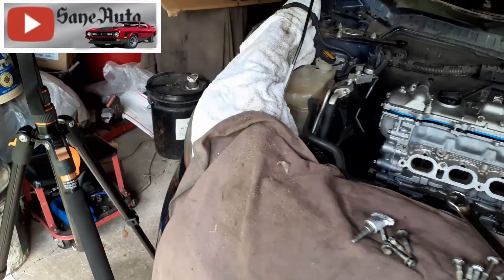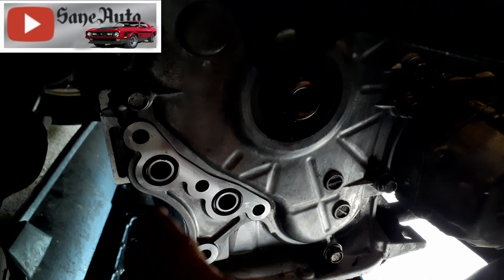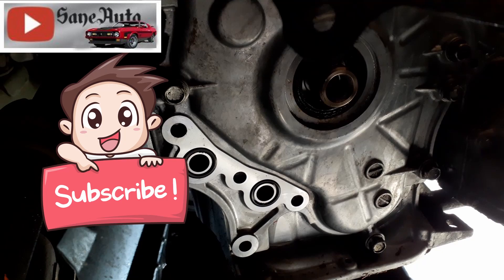Let's take a look. Go over to the passenger side — and you don't have to take the wheel off like I do. There is a filter housing right here and the filter faces over toward the transmission. The whole filter housing bolts on here, and I've taken it off so I can get it on the bench and show you everything you need to know about the filter on a Prius.